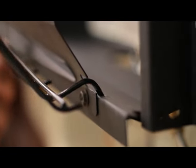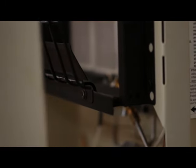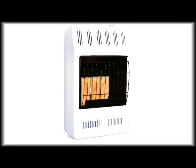Replace the grill guard. Replace the cabinet front with 4 screws. Use a soft cloth dampened with a mild soap and water mixture to wipe and clean the exterior of the cabinet. Your vent-free heater maintenance is now complete.